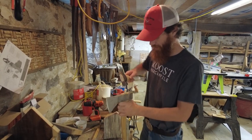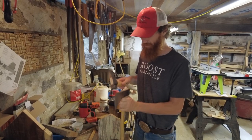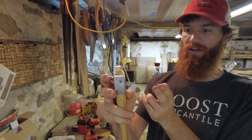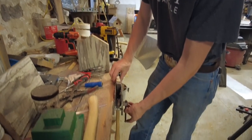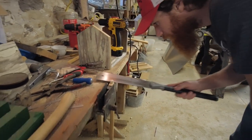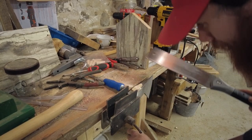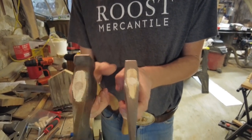We're going to use the Camp Carver to beat this in. You can hear it set just like a normal wedge — hear the tone change. Then you can see how it flares out. The top of that handle is actually proud and it's flaring out even more than it was with that steel barrel wedge. We're going to clamp it, cut the excess off.